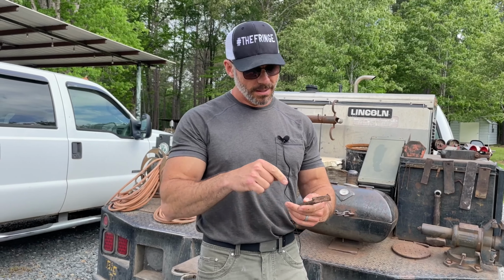So that's right there. My TIG gap, 1/8 welding rod. It's real simple. It's 1/8. I use a 3/32 TIG wire because I can scoot the gap that much closer. I don't mind feeding the wire. It's less to weld. Anything you can do to make it less, you know, so weld small. Think weld small on everything. You'll use less rods, and you'll be faster, and you'll be done before everybody else, and you don't have to work as hard. It's the main thing. You can get more done if you're not tired every day.